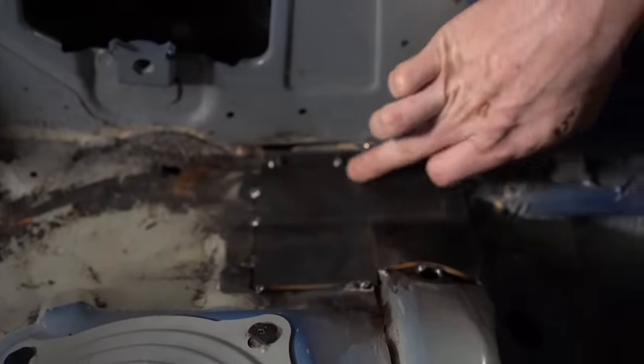So here I have a measurement of when the chassis starts to move in, it's around 23 inches. I think it's safe to say that we start our bend around 24 inches. Because the tube has a large radius, it's not actually 24 inches and then over. It's going to be pretty gradual. That's where I want the center of my bend to be on this particular main hoop.